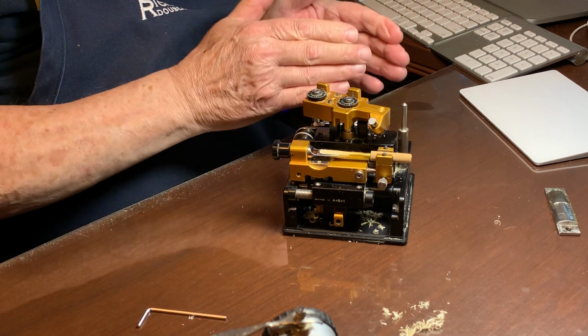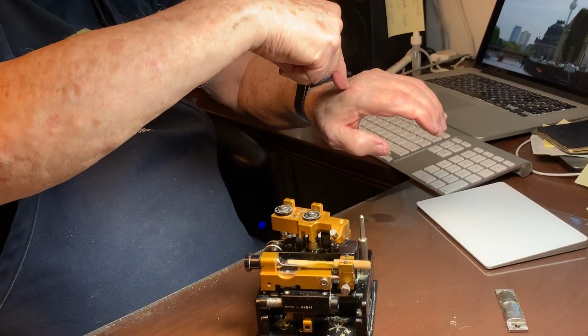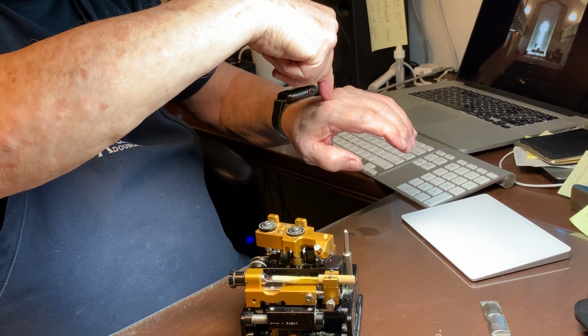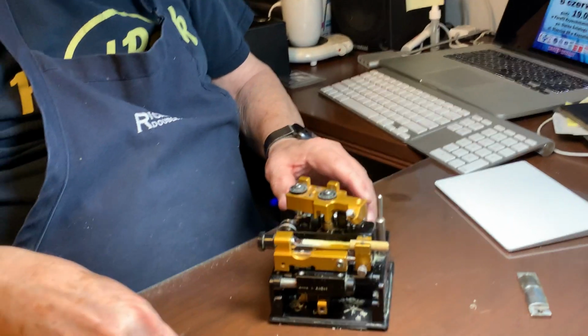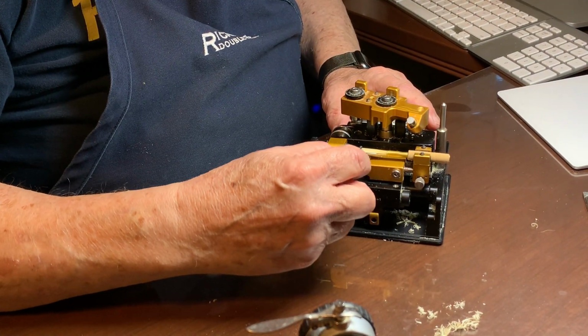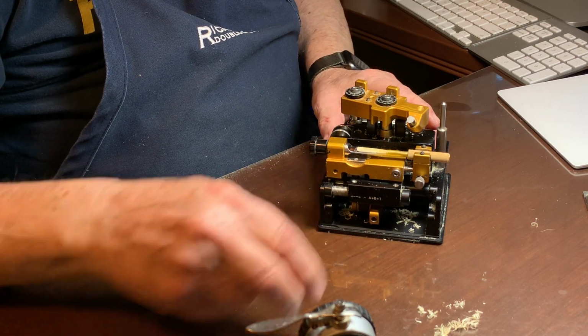And that's moving the template this way. And as that curve moves one way or the other, where this hits, as you move the curve there, this hits higher and adds more length or strength or thickness to the tip that you're using. Notice also that if it's thinner here, it will also be thinner back here, although it's not going to be as noticeably thin because the back is always thicker.